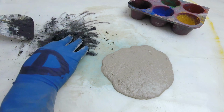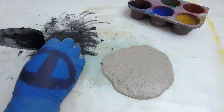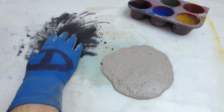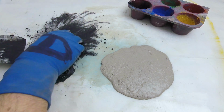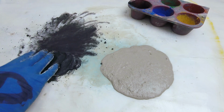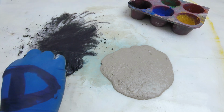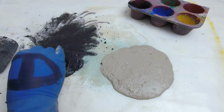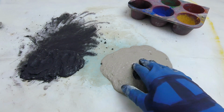So the color we're mixing right now is a color that I call charcoal, or sometimes called black, but more accurately, it is charcoal. Why is it charcoal? It's charcoal because it's never going to be a jet black as night, gloss black. Number one, concrete by its own nature is not gloss. It's got a little bit of a matte satin finish. So that alone, if you can't get a gloss, your black is never going to look black. Number two, concrete's creamy. There's a natural creaminess to it. And that actually is a big factor.